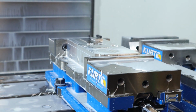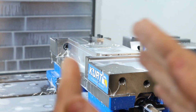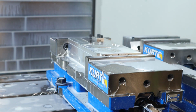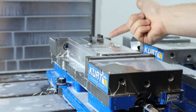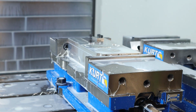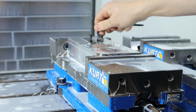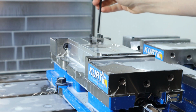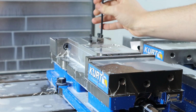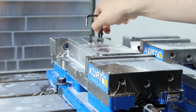Well, I saw it move down, so that must mean it works. What I should do is extend the block out this way and put that foot farther back. So like bring the block this way a little bit and then extend that foot, and that would give us more leverage, because obviously the bolts are right up against it. So yeah, I think I'm going to do that right now as opposed to fixing it in the future. Might as well fix it now. But this does work, so that does prove that that's the proper way to do that. Obviously everyone knew that, except yours truly.